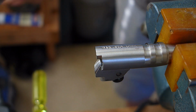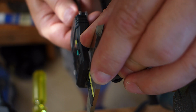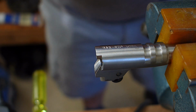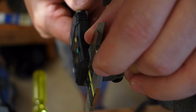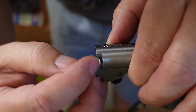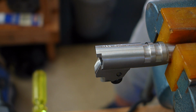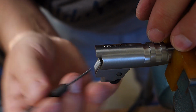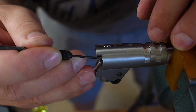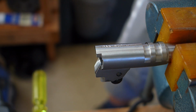Tricky. So you've got to have this surface correct in this direction and in this direction. So yeah, it's tough for me. Seems like when they milled this face right here, it's not at a single level all the way across. It's milled a little more right here and right next to the barrel hood extension here. It's a little higher. You can see that maybe, how the punch is catching on that. So that's kind of strange. I'm not sure why that is.